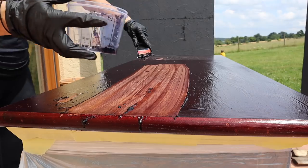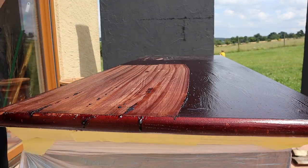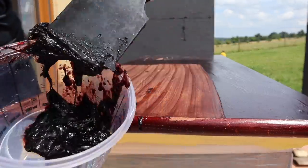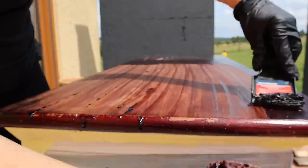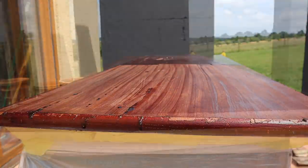This is a veneer top, and so it's very important that you are careful with veneer. You do not want to blow through it. That is why I use a chemical stripper when I do veneer. I don't generally sand the veneer all the way because it's really easy to blow through it, especially on pieces that may be compromised or you don't know what the finish looks like.